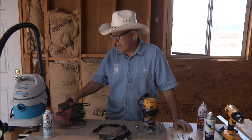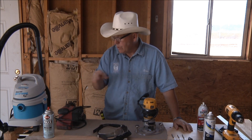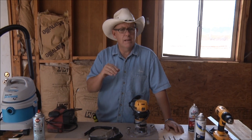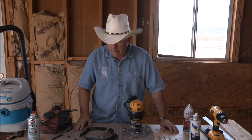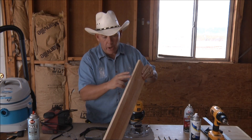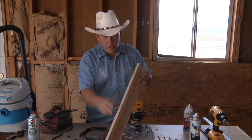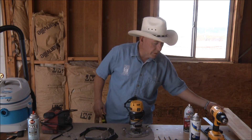These are a little vacuum that you can use to suck the sawdust off, but I use it as a blower — I've answered that a couple of times recently. And the drill: I always drill my boards — my signs this size — at 12-inch centers, so six inches from each end, top and bottom.